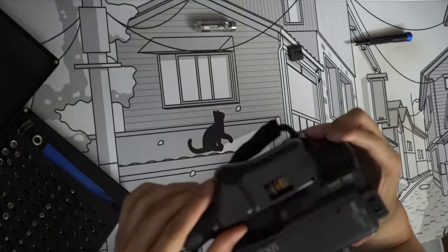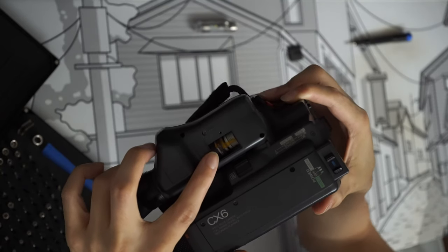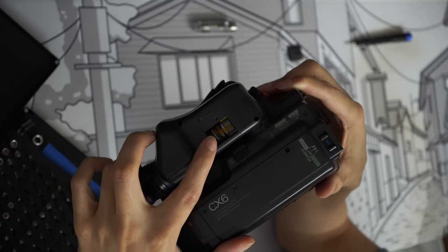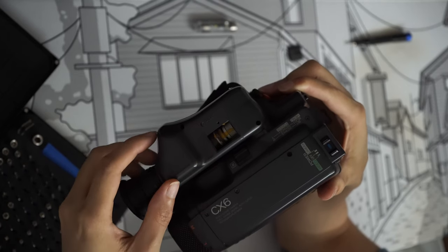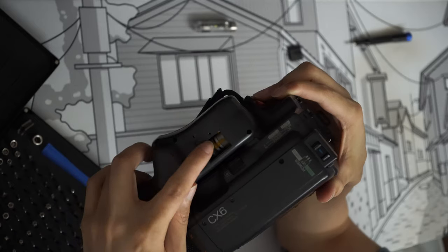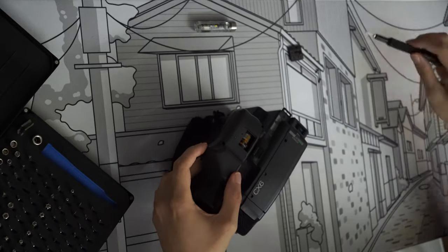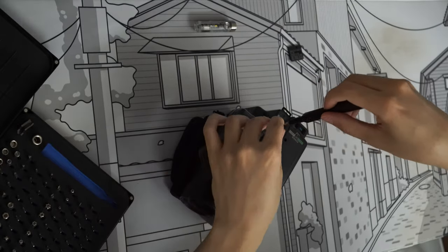It actually gives access, if you can see here, it gives access to the neck of the CRT with the rings to adjust focus, convergence, and actually not convergence because this does not have color, but focus and geometry and stuff like that. So that's really nice because you don't risk touching something that you should not. You just have access here. It's really nice. Obviously, I'm not going to touch this. I hope the CRT is set up properly. If I have to, I'm going to remove the glue here and try to turn these, but hopefully I won't have to do that. I don't think I should have to do this because these small CRTs don't really go out of calibration easily. At least not the ones that I've seen so far.